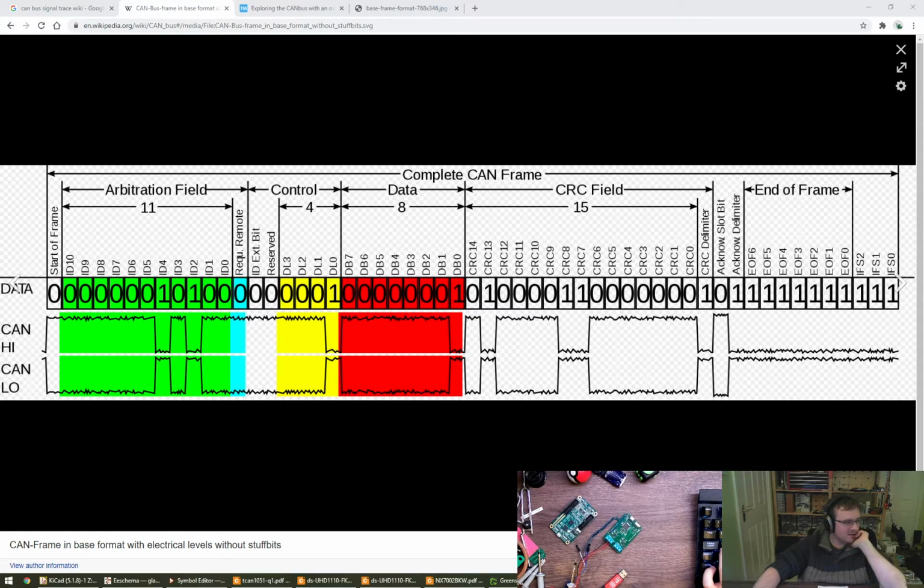Will C said, if you want help testing, let me know. I work on a number of different vehicles. An easy way to ground CAN low would be fun to have so you can talk to single wire CAN networks. It's a hack, but it works. So what they want to do is pull CAN low permanently to 0 volts, leaving CAN high floating around. I guess if CAN high comes down to 0 as well, that's probably okay actually.